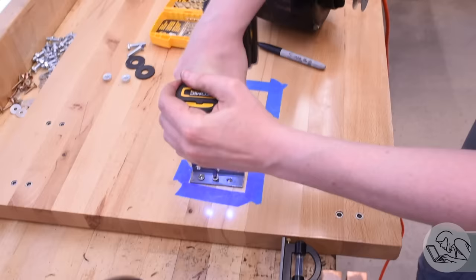Quick safety check — yeah, look at that, finger safe, scientifically proven. I need some decent electrical, so I picked up a machinery switch with a built-in E-stop paddle — 35 bucks on Amazon. A little spendy, but it's safety equipment so probably best not to skimp. I attached it to the leg of the table with a standard electrical box, crimped up some connectors, and wired it in. Very quick and easy to install. And hey, look at that — it works and it's die filing just like it should. This switch is nice with that built-in paddle for E-stop right at knee level, so if I need to shut it off in a hurry I can.